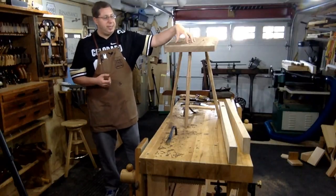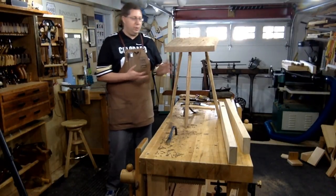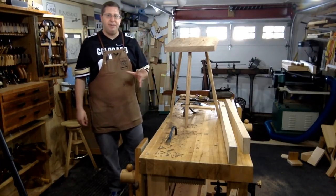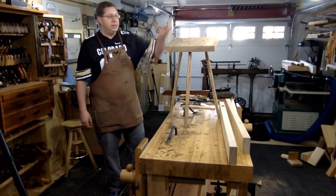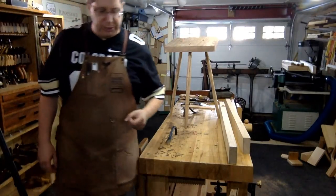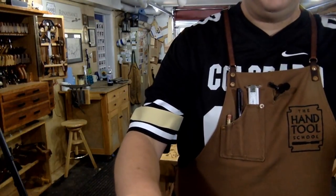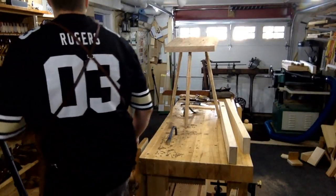For this particular piece, because there's no steam bending going on, this is a great introduction to Windsor geometry. We don't really have to have super, super green wood or anything. It certainly makes things easier, but we could just use regular off-the-shelf lumber for this. So, a long explanation for a seemingly simple question, but yes, you do need to think about what wood you choose for this. That is the true brilliance in the Windsor chair form.